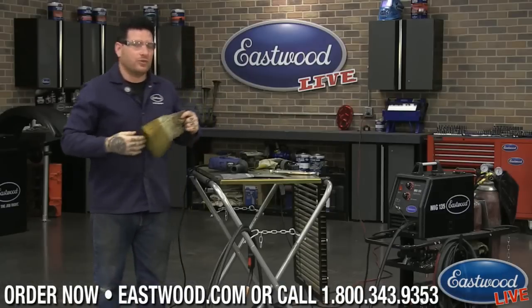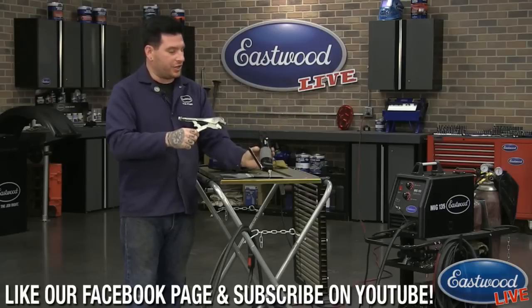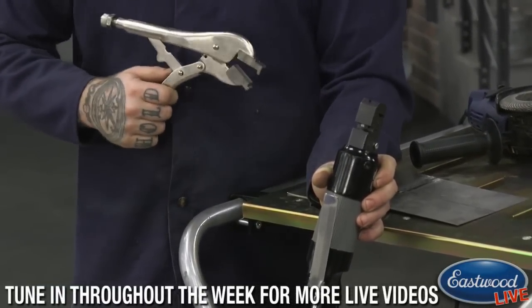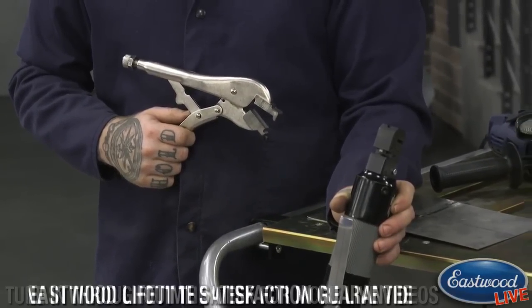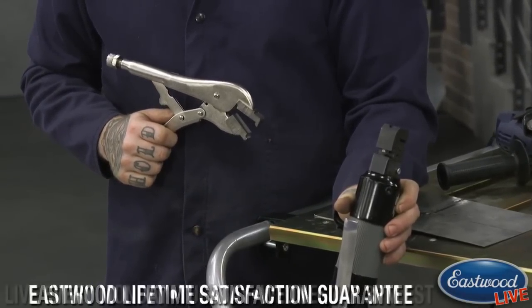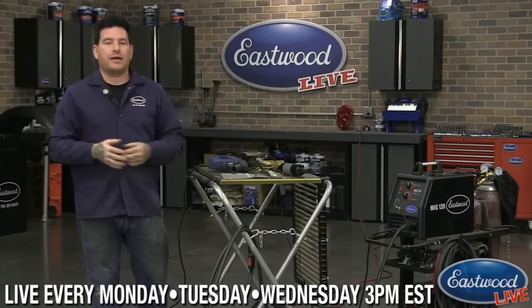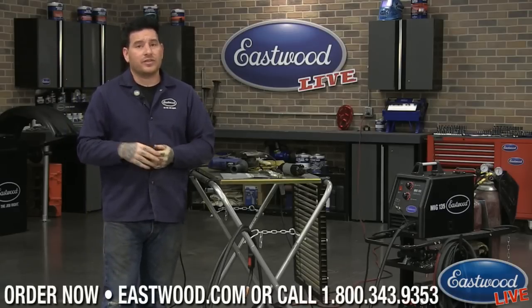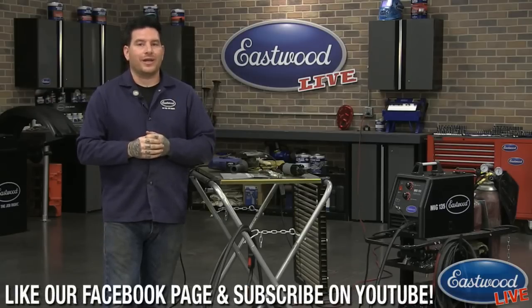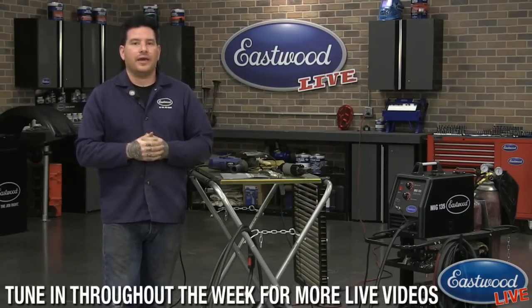The Perfect Panel Prep Tool is really good for those doing repairs on sheet metal work. It's good up to 18 gauge steel on both the handheld and pneumatic versions. The pneumatic version, as Scott mentioned, also has a hole punch built into it so you can do bevels for butt welds, and if you're doing plug welds or spot welds it's really nice — punch a hole in the top layer, fill it up with your MIG, and do really nice spot or plug welds. You can grab these products through the link in the comments, purchase right on the site, and there's also a great Q&A section where the techs will answer your questions and you can see customer reviews.